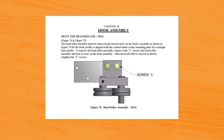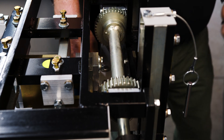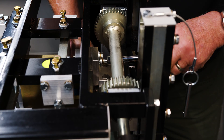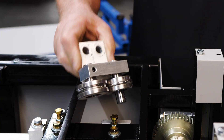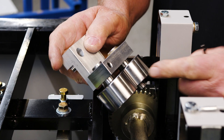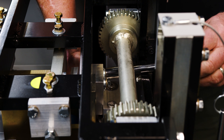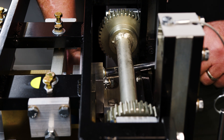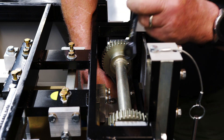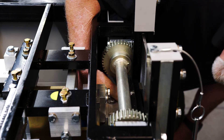The next thing we're going to do is remove the bead assembly. These two bolts right here — you switch it from five to six. We're going to remove it and install a different one to control the hem. This is a crimper or bead assembly on the back of the gutter that we removed. We're going to install this one, which helps bend the hook down and hold it in the correct position for the shear. Now that we've got the bolts lined up with the back plate, we're going to bring this in and snug it up. We don't want to tighten it all the way because we're going to have to adjust it to the material coming through. Check it and see where our height is going to be — normally you can put it in the same spot of markings where you had your old one. Make sure we're all lined up and we look pretty good.